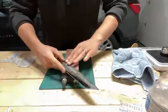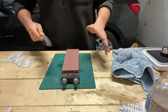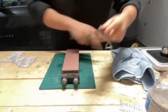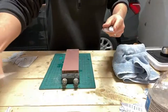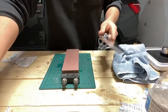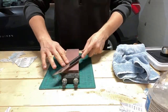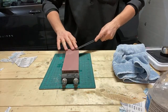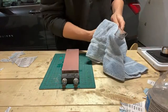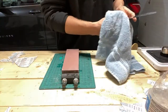And so with a diamond stone like that, and the Venev, if they leave a satin finish, like a Belt-Grit or sandpaper, like when you buy your Spyderco, they leave this finish on the edge because they don't make a slurry. And it's not awful. And I think the Venev 1200F edge can look really nice, but it's not my favorite. I'll say that. So I kind of like having something that'll slurry.